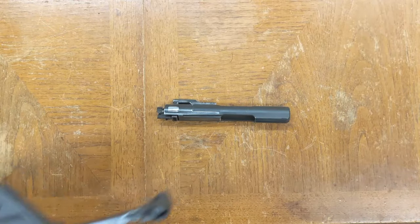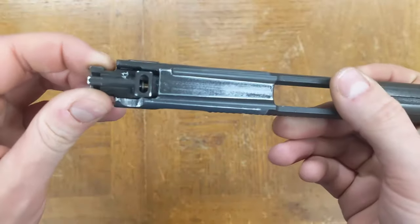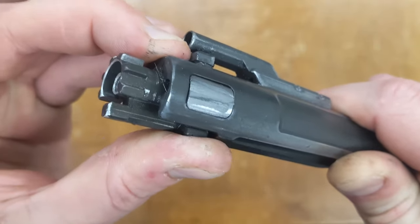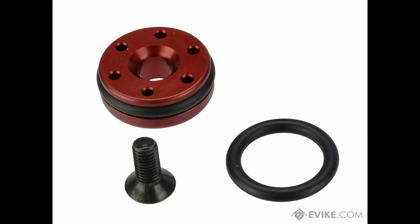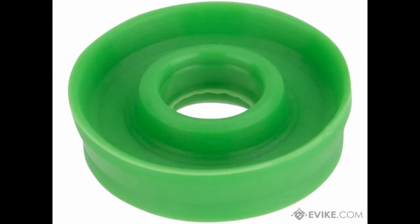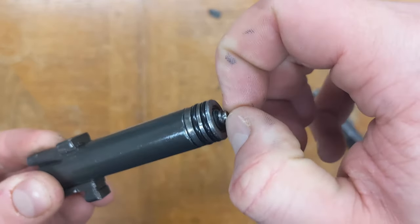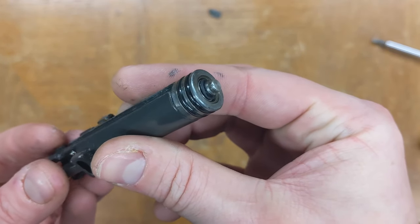Poor seals will cause leaks regardless of input pressure, but this has a major impact at low pressure. The biggest culprit is usually the blowback system in the carrier or slide. The nozzle should not be tight in its track, but if the apertures on the front and underside are plugged, there should be noticeable resistance when pushing it into the carrier or slide. If not, the seal may need to be replaced. We've noticed that ported piston heads with O-rings tend to seal poorly at low pressure, while cup seals or just plain O-rings do better. Also, if the system uses a sealed plug to retain the nozzle spring, be sure to check the O-rings there — missing or damaged O-rings in this area will substantially compromise performance.